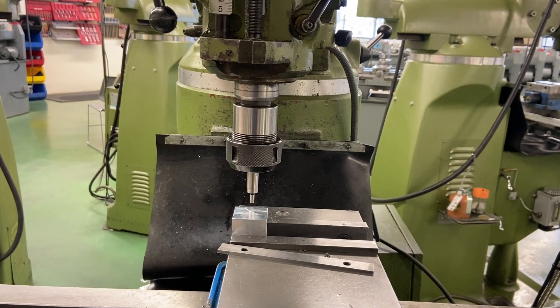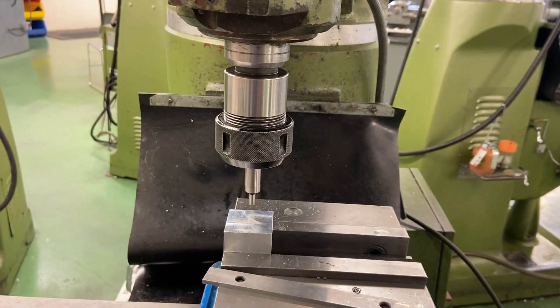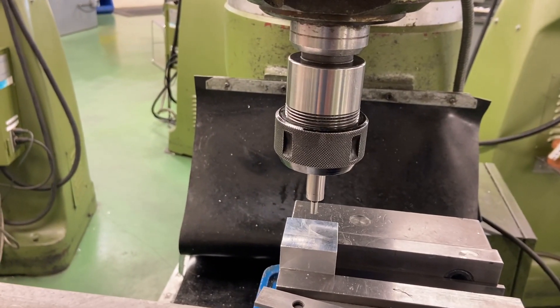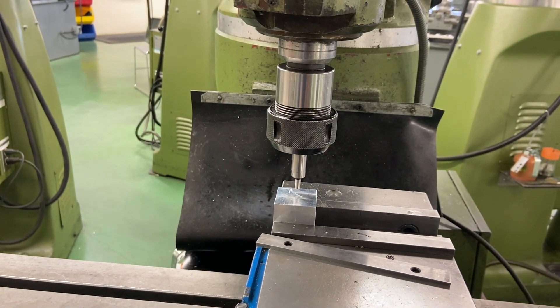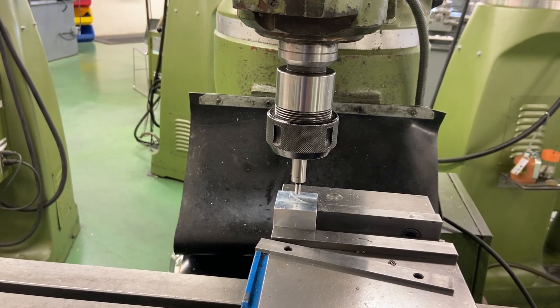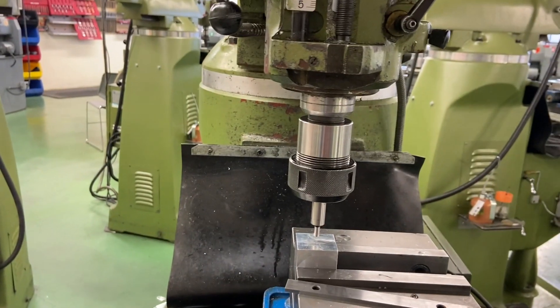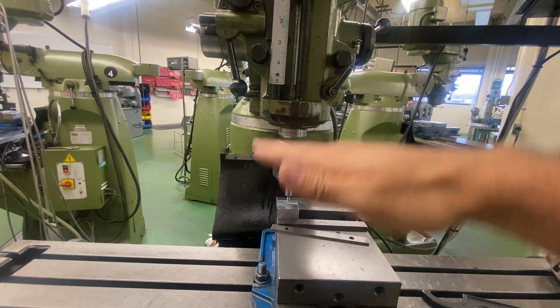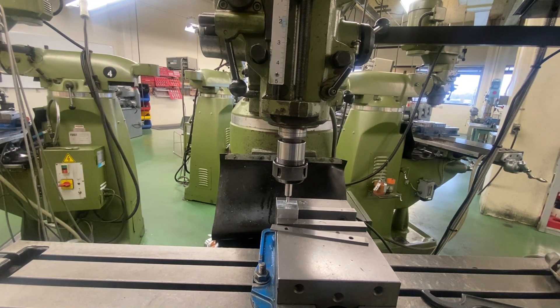If I change directions in my movement, I also need to be aware of my backlash — just keep that in mind. There's a video on lathes where I talk about backlash and that still applies here. So I'm going to move now the distance that I have. Now I have my spindle in the center of it this way as well as this way. That's the two ways I can use my edge finder. Thanks for watching.